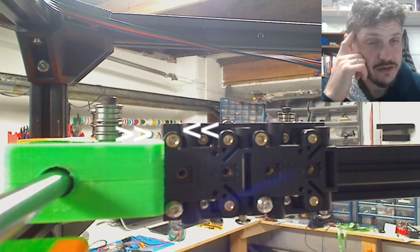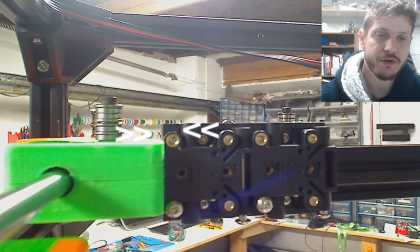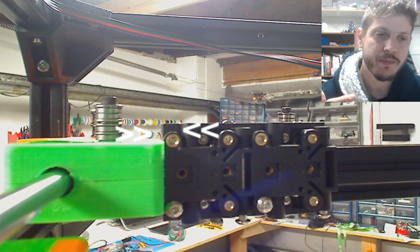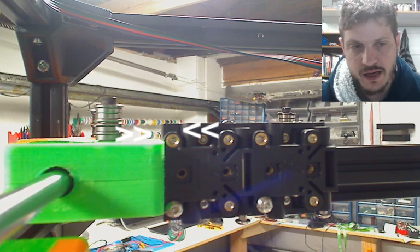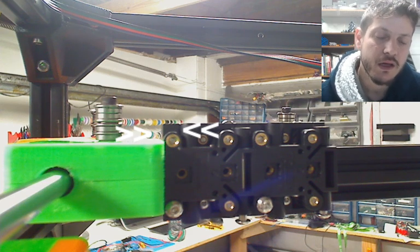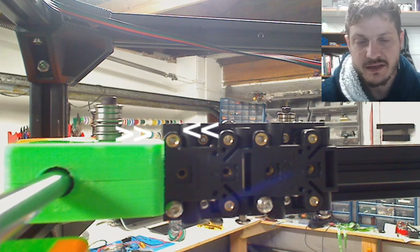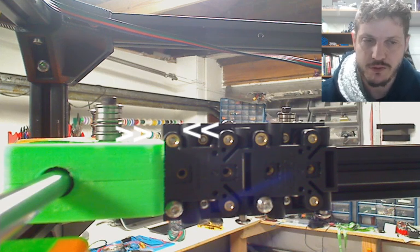If you're not going to use the exoslide, you don't need to raise anything. For example, if you use a linear rail on top of or below the 2020 extrusion, or a traditional carriage like those used on D-bot or delta printers that ride in the grooves — like Creality-style carriages — you probably don't need the 14mm raise either. Raising by 14 millimeters doesn't really have a negative impact; it won't reduce Z height and if anything it just stiffens the part.